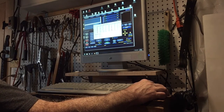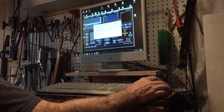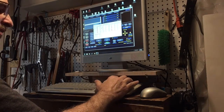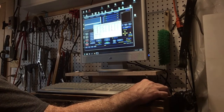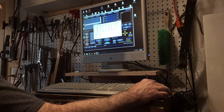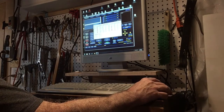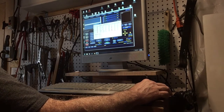And I'm setting this at 47.5. Well, I only drove 47.47, so I'm going to go, let's say, 47.45. That would be the absolute maximum. Soft minimum is 0. And then here's where you put your slow zone. So it's going to slow down within 1 inch of the end of the 47-inch travel. And auto zero checked.